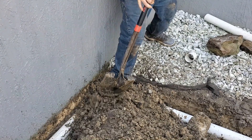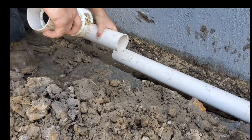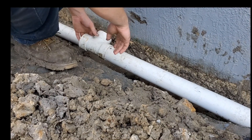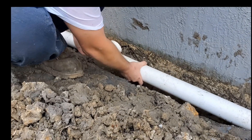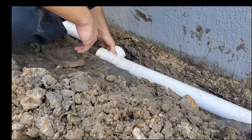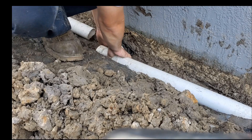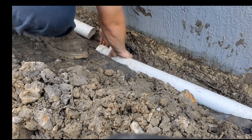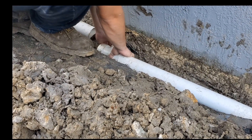That looks good — now just stomp on the corner. Now we can backfill. It's pretty hard to put pipe together when you're tired and bending over. Some people think that's the fun part of the job, but it takes a lot more effort than you'd imagine. Because we found that extra core through the wall, we're able to attach a T here to help this discharge. We actually have a full bubble of fall, but adding that T is going to help a whole bunch.